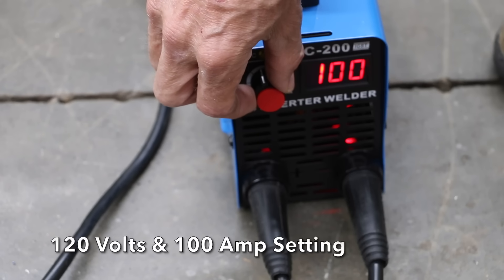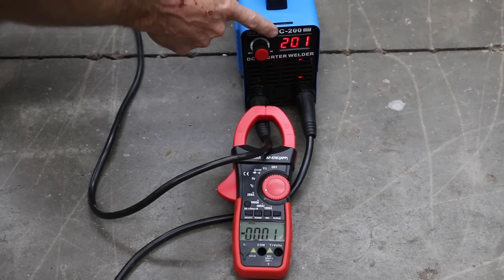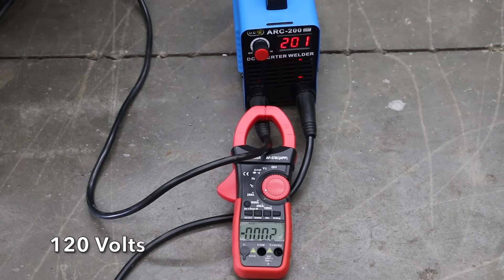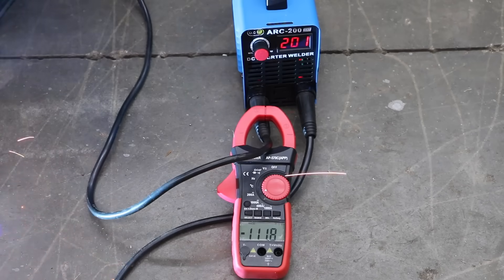Let's start off at 100 amps, then test the welders on the highest setting. The S7 made it to 73.1 peak amps, or 27 amps short. Dialing the S7 up to 201 amps, it made it to 113.7 amps before dropping back — coming up almost 90 amps short.